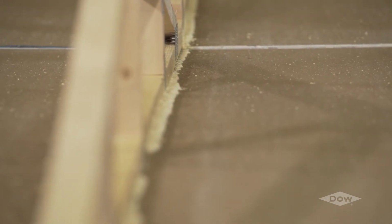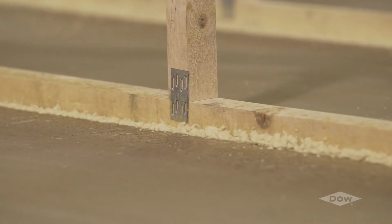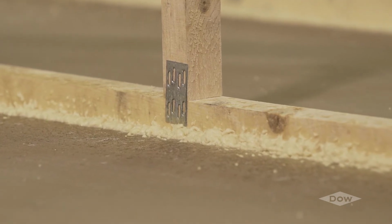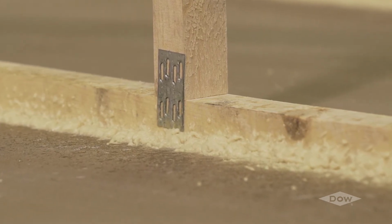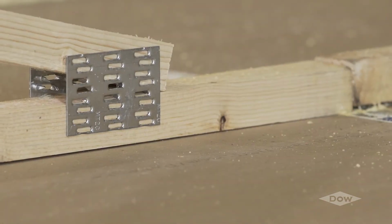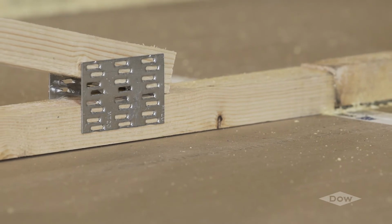VORAMER 3022 is designed to be the easiest product of its kind for application. It rises quickly upon application, allowing the operator to see where and how much material has been applied to the junction between the truss and the ceiling board. Ideal application includes applying liquid foam stream just above the junction on the truss. Foam stream will bridge gap and form a foam bond between stud and sheetrock.